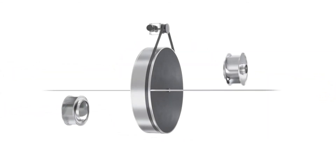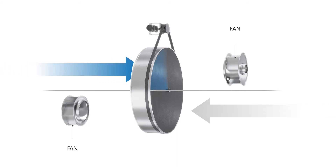In an adsorption dryer, the adsorption material usually consists of a highly hygroscopic silica gel, firmly embedded in a slow-turning rotor, rotating continuously between two separate air streams flowing in opposite directions.